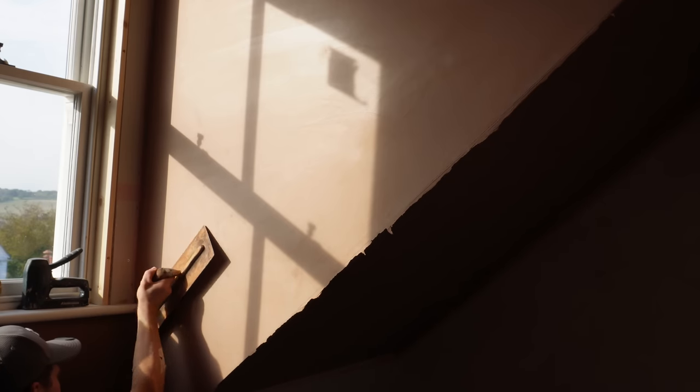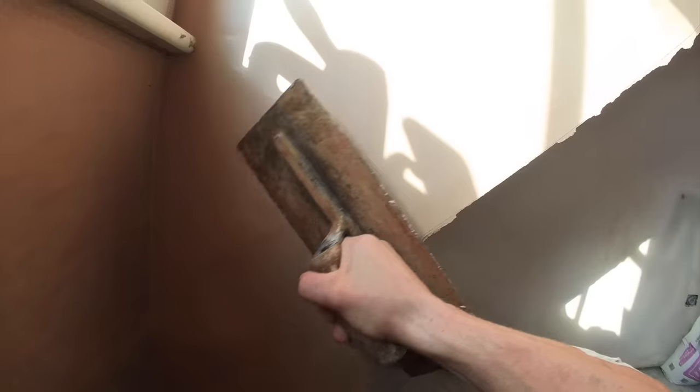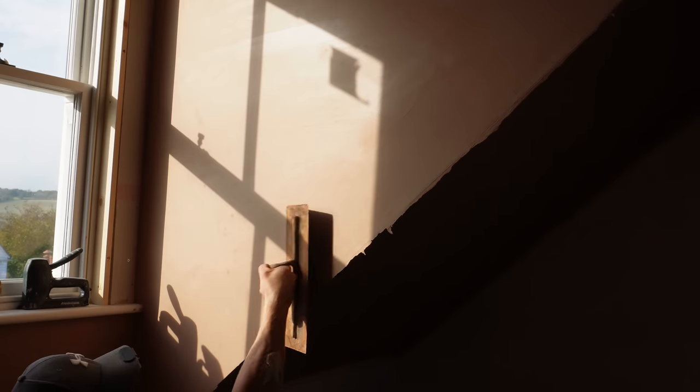Start cleaning up on the details, making sure everything's filled in. Wetting the edges — you can run into the bead, but the best thing is to run the trowel parallel, applying a lot of pressure along that bead and using the bead as a guide. Fill any remaining areas. That is the right way to fill corners and make sure they're dead flat. Everything after this point is the same, except for the penultimate trowel, which is what we're going to do now — that gives you bang-on, perfect square reveals.